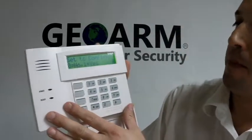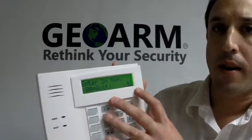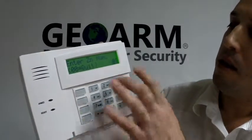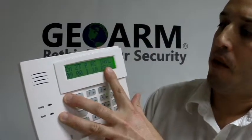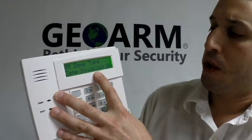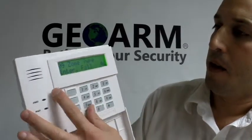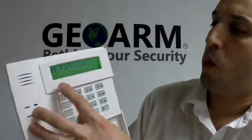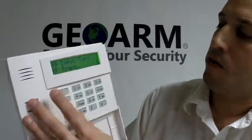We're not going to confirm as of now. This is a hardwired panel, so zones one through eight are hardwired. Zones nine and up are going to be your wireless sensors, so we're going to start at zone nine. Hit star and it's going to show you what's programmed in already. Hit star one time and we're going to program this in as a motion, which is interior follower 04 on these panels. Star, partition one, star, report code one, and RF trans three — that's all correct.